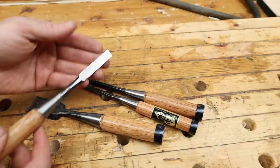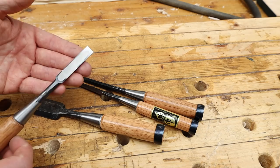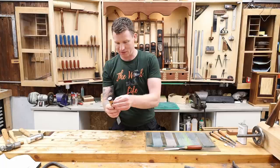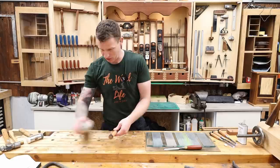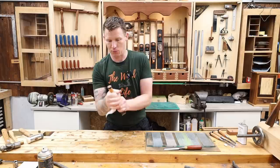I've already done one — you can see the mirror finish where I've flattened the back and sharpened the blade. These things get scary sharp. Now let's prepare the 30mm one. First thing is to get this sticker off — eventually it wears and leaves sticky residue on the handle. I'm going to use a bit of electric contact cleaner to get the glue off, then we need to remove the hoop and reset it.